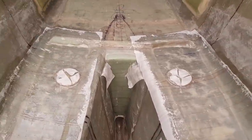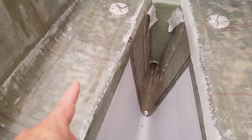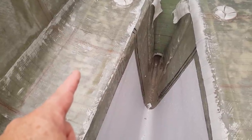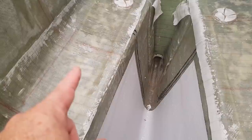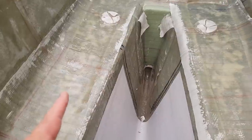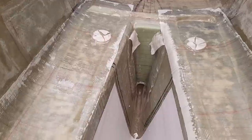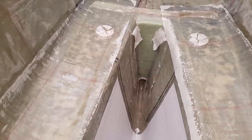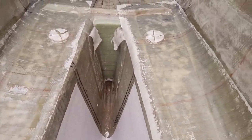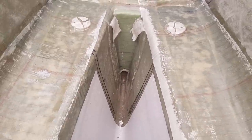That only took about half an hour — I'd been putting it off for ages. So this here now would be two layers of 300 CSM on the gel coat, layer of 1,200, layer of 300, layer of 1,200, layer of 300, layer of 1,200, layer of 300, then two more layers of 600 double bias on both sides. That's the engine room spec — essentially what we constructed from the survey report that ensured we didn't have the foam in here. Just making sure all my bases are covered prior to putting the module in.